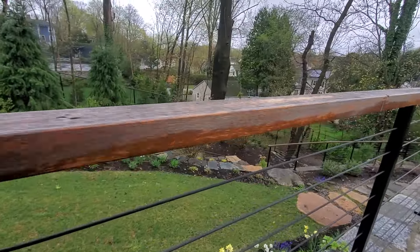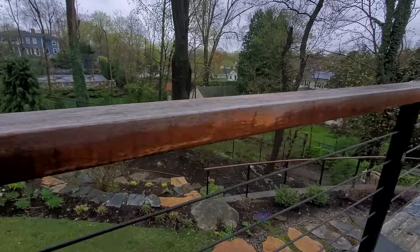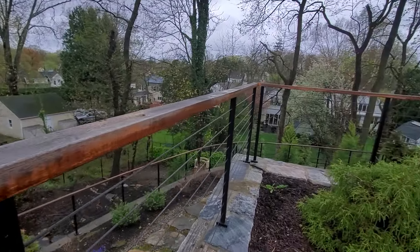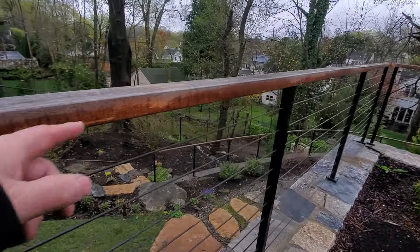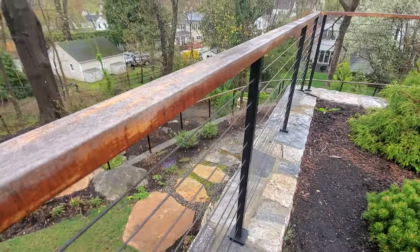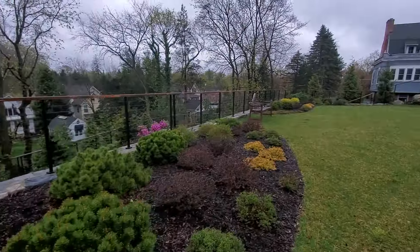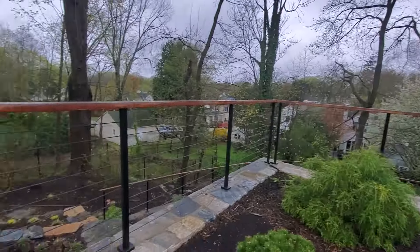This is very straightforward — it just has a surface film of polyurethane. It really needed to have a penetrating oil, because that's the only thing you use outdoors that doesn't end up looking like this. You need penetrating oil. This is a surface film building treatment, and it's basically no good.